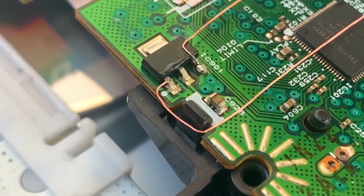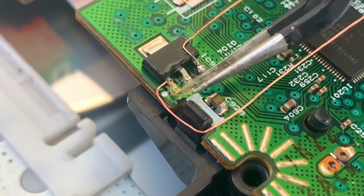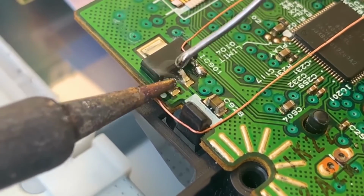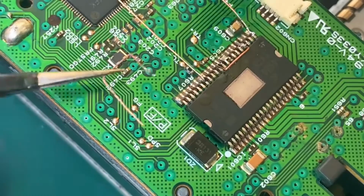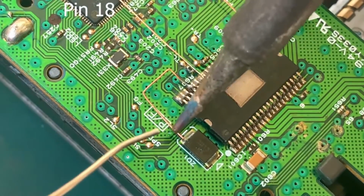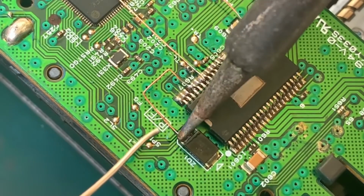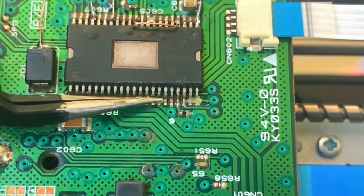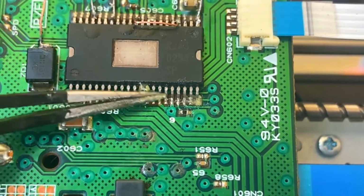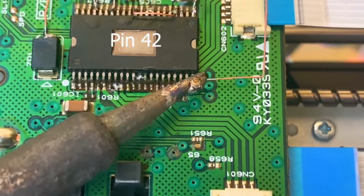It's kind of an interesting idea using enamel-plated motor wire for bridging wires like that. It does make it quite a bit easier than having plastic-coated wire that you have to strip the tips off of. So everything this person's doing isn't completely bogus, but let's just think about this. He's soldering wires all over an area where the memory has been erased on this IC.